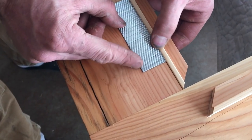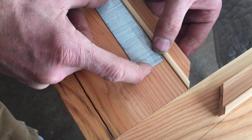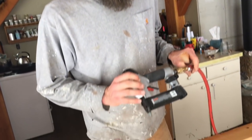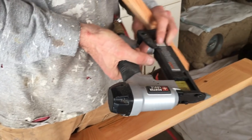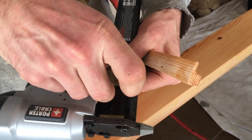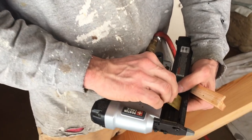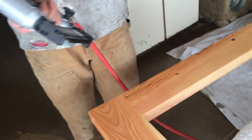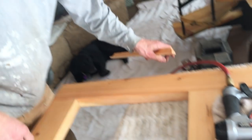So I just have a predetermined distance that I'm setting this proud of the rest of the door. I've done all my math and measurements and have determined that the head of this row of nails is a good spacer. The gun I'm using — I like it quite a lot — it's called a micro pinner. It shoots a very small 23-gauge little tiny pin. When those go in, you can hardly see them at all. These are a little oversized for what I'm doing here, but they still sink all the way, and those are the only length I have.